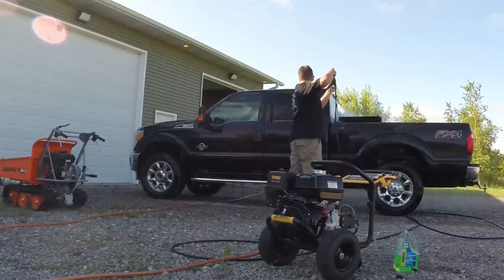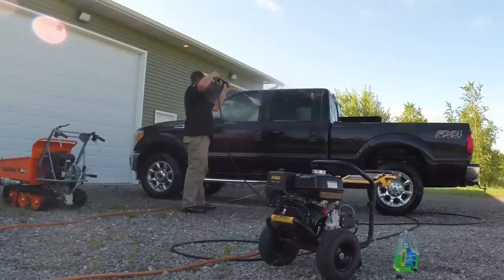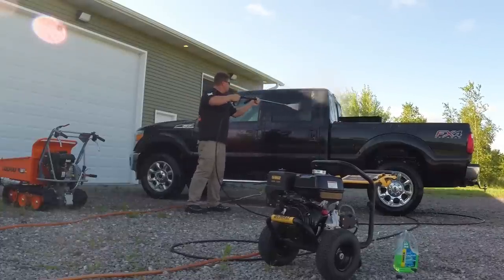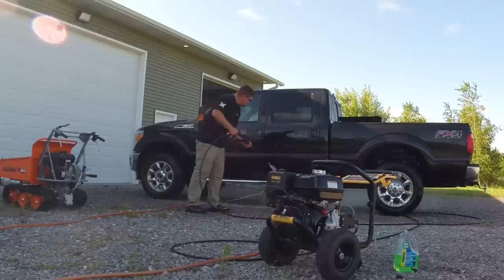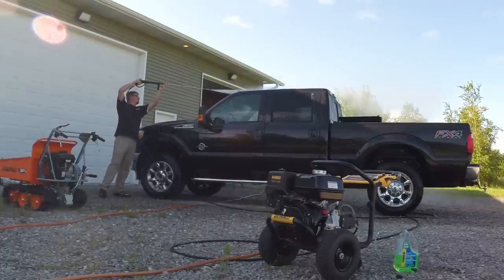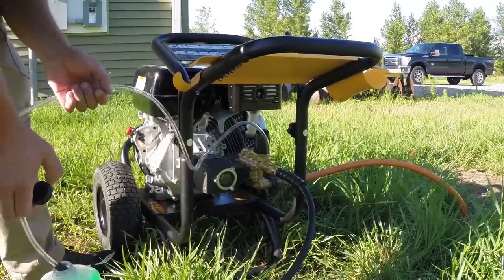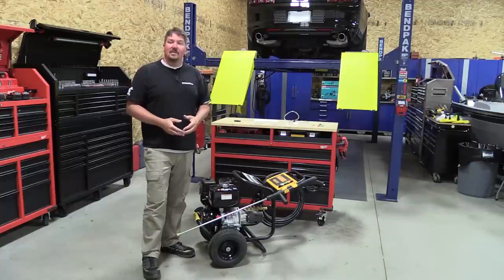Other than those few suggestions, this unit really rocks. If you're new to pressure washers, be careful — you have a lot of power. You can tear stickers off cars and ATVs, leave marks in cement, and even cut through vinyl siding at 4200 PSI with the zero-degree nozzle. Take your time, learn the machine, dial the pump back, and increase pressure as you get more comfortable. If you're considering this unit or other DeWalt models like the 3800 or 3600 PSI, stop by workshopaddict.com or ask questions below. Give us a like and subscribe for more reviews.